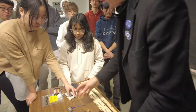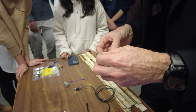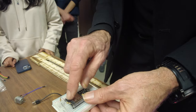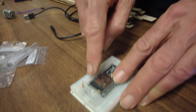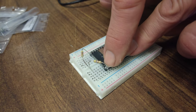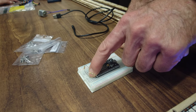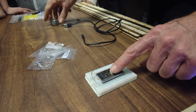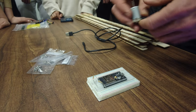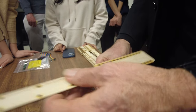You've pushed this down to start. You've got two 470 ohm resistors forming a voltage divider across the outside. The voltage divider goes from ground to the plus 3.3 volt pin — the one opposite the ground — so the midpoint is halfway between ground and 3.3 volts. That midpoint is a virtual ground for the motor, and the blue wire goes to that virtual ground.